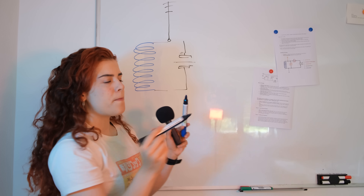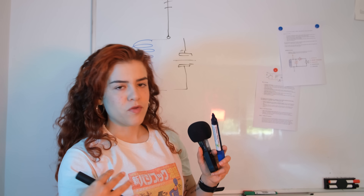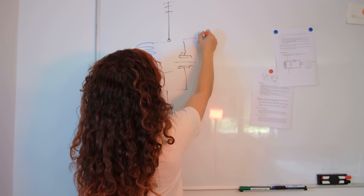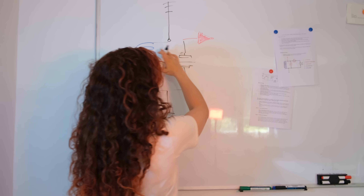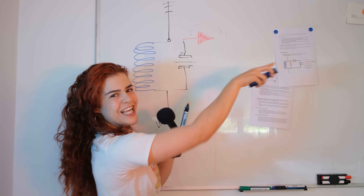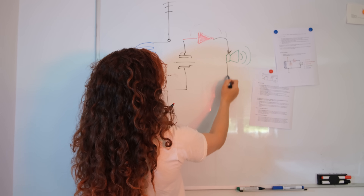You can think of this also as a small battery, because we don't have any power that actually powers our radio. What we need to do is strengthen the energy that is coming from the radio waves, and that is what this thing here does. Down here we have a ground connection. From here on out we have our diode — or this would be the crystal, if we were using an actual crystal. The diode basically sends the electron waves down in only one direction — it's a one-way flow for electrons. And where does this lead? That one-way flow leads to our earpiece, which also needs to be connected back to the circuit.